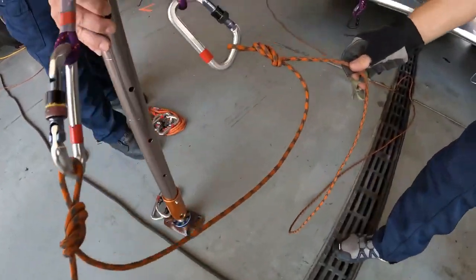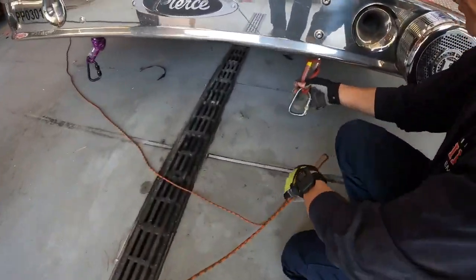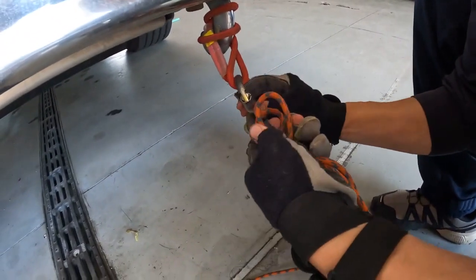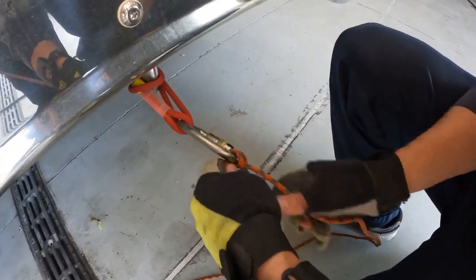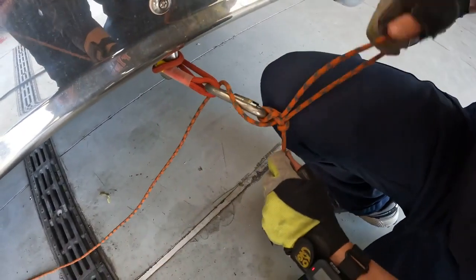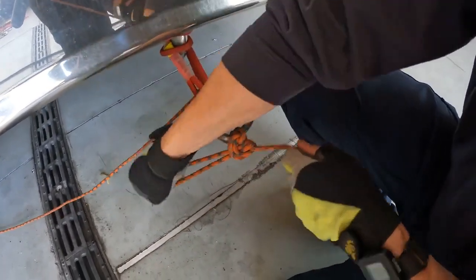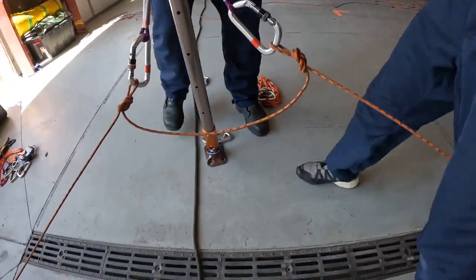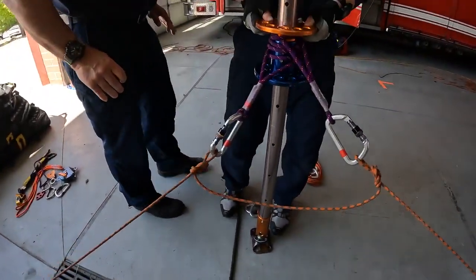Keep this pitch forward in the direction of pull, about five to ten degrees — that's what we want. Going to this anchor point down here which represents roughly a 90-degree angle, fold it in half, choke this up a little bit, get it hand taut, then re-align it for a lower and lock this off.